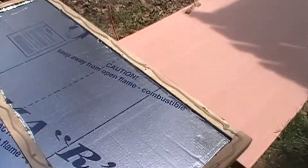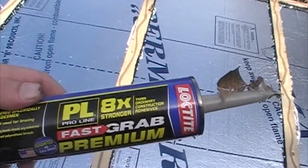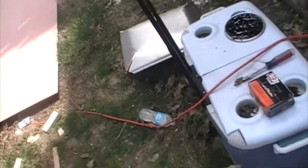You want to go all the way around each one of those studs and put a bead of glue to get ready for that sheet of luan to go on there. This glue or something similar — you don't have to use the 8X; I actually picked up some 3X or something. As long as it's waterproof, that's all you've got to worry about.